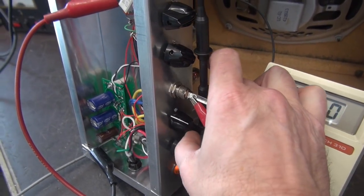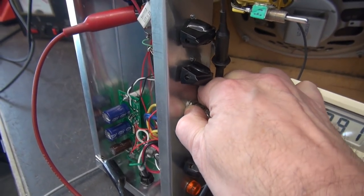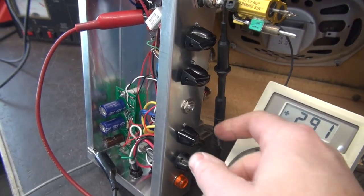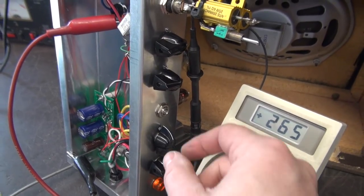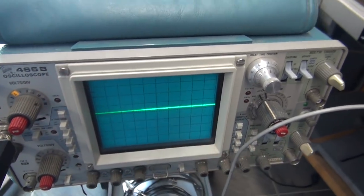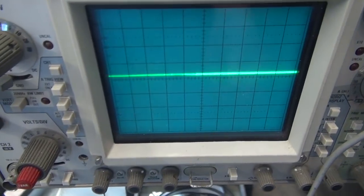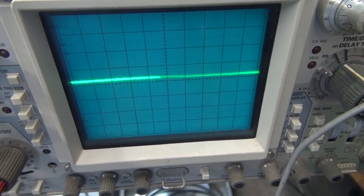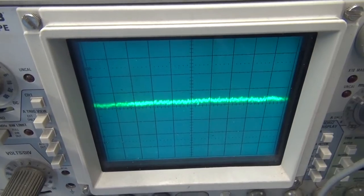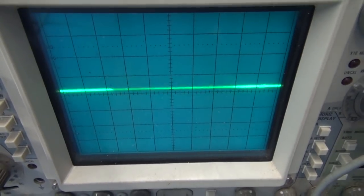Let's take the volume all the way down and disconnect the input. Going back to tube mode — high voltage went back down. Bring the volume up full blast and look at the scope down to about half a volt... I don't see anything. At 0.2, at 0.1, you can see a little bit of hiss. Treble all the way up — treble back down — then volume all the way back down. Clean as a whistle.